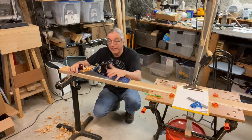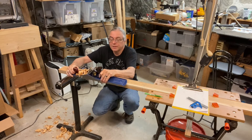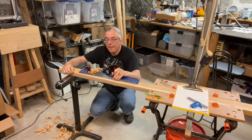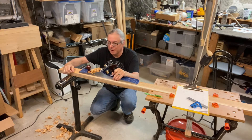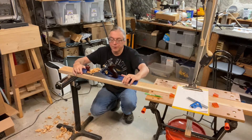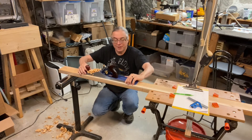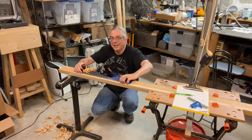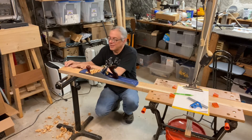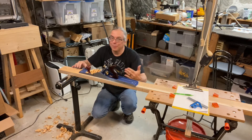It's really tempting — and I think I did this in the first series — to be holding the plane at an angle like this or like that. I've got a really thin strip doing that, but I think that's a bit imprecise. Holding the plane flat against the board is a better way to do it. It's interesting because the board is flat and I'm trying to cut an angle, so I'm actually trying to lift the plane a little bit. As I get further along back, it's going to be angled but flat.